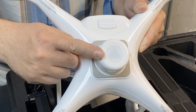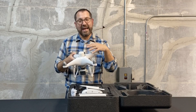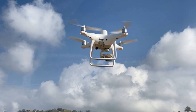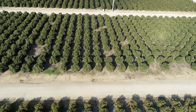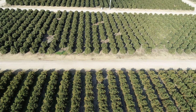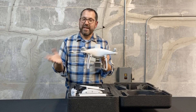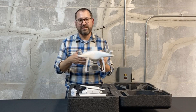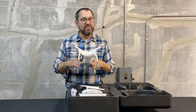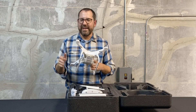We also have an irradiance sensor on here. This will tag all of my photos with the incoming light data. As the drone is flying, the sun is shining down, and whether it's a sunny or cloudy day, we need to know how much light is coming from the sun to do radiometric corrections. That really helps us compare our plants from one day to the next, even if the lighting conditions change.